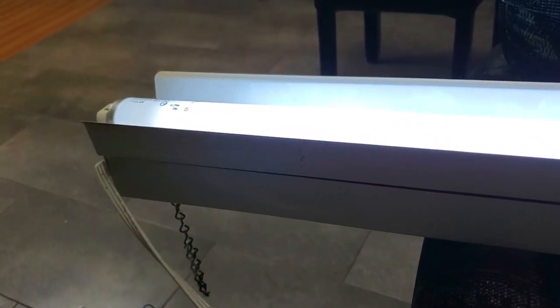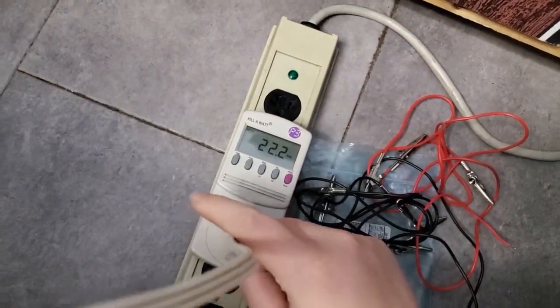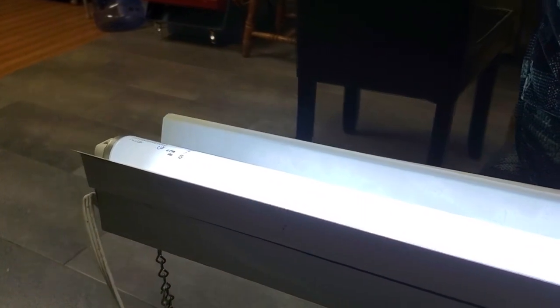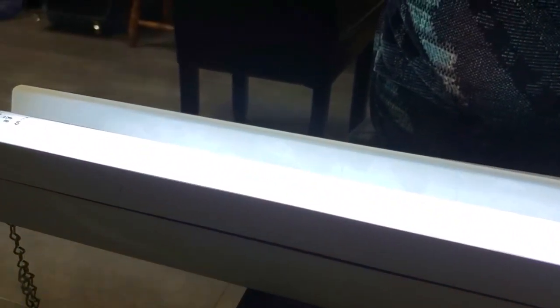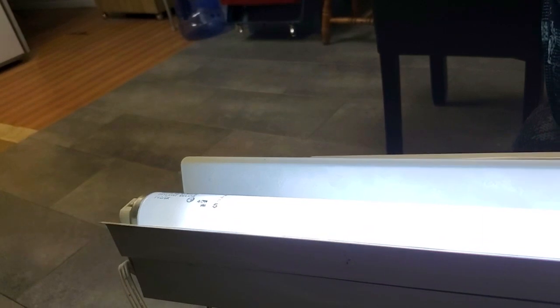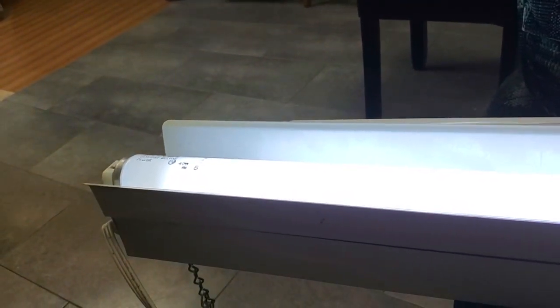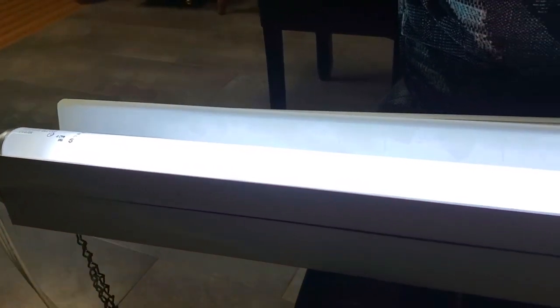I never run this lamp, so it's probably a little bit on the stale side, which is why it wouldn't start easily. It's not very bright - F40T12 wants a lot more current than an F32T8. So what's our power here? 22 watts. We're doing better than a residential-grade magnetic ballast. If this was the ballast you had and you didn't need a whole lot of light, this would be fine. And because of that preheating before it starts, I don't think there's damage to the lamp. The ballast keeps the cathodes preheated a little bit even after the lamp has started, so the amount of underdriving going on here shouldn't reduce the life of the lamp.